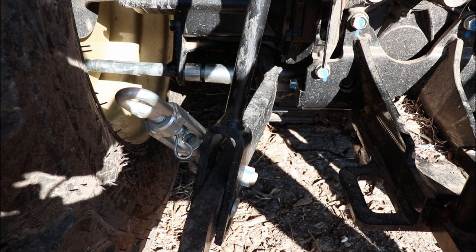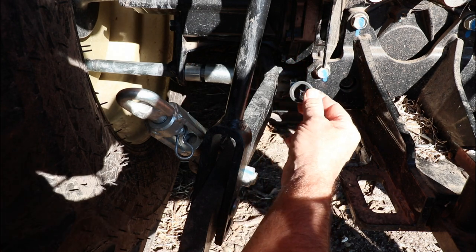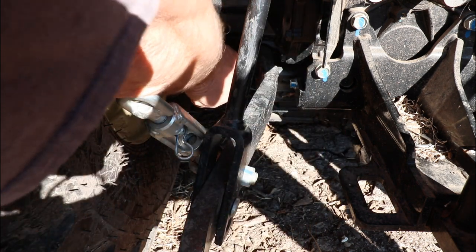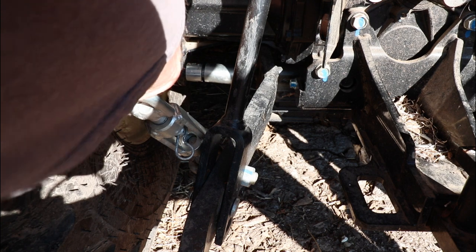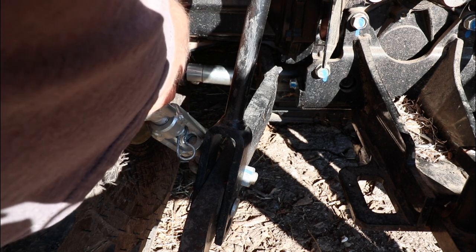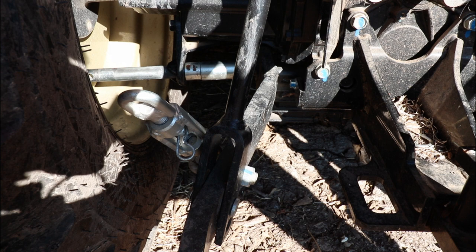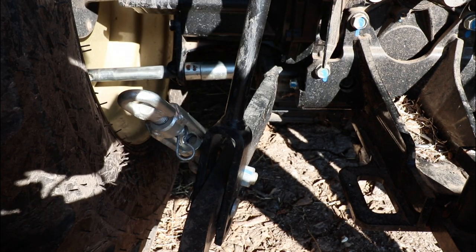I've got the three-point hitch up. Right between here where the little ball is, this little bushing fell out that goes in there, so I've got to keep up with that. Now I'm gonna see if I can move this out of the way far enough that these two spacers will come off — that's easier than taking the wheel off the tractor. I can move the pin back and forth now. I'm trying to avoid taking the wheel off because I don't want to scratch the wheels on my new tractor. Now that I've got it loose, this arm is in the way, so I may even have to take the upper pin loose just to get this to move.